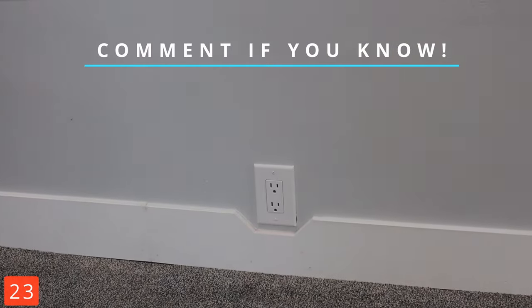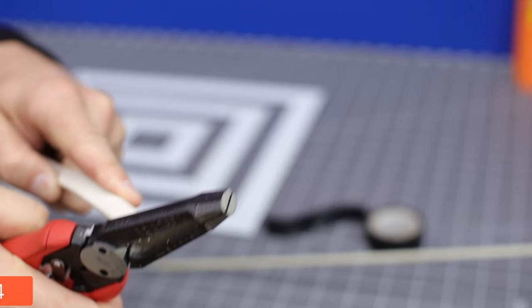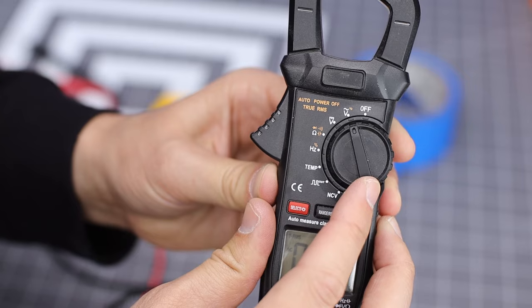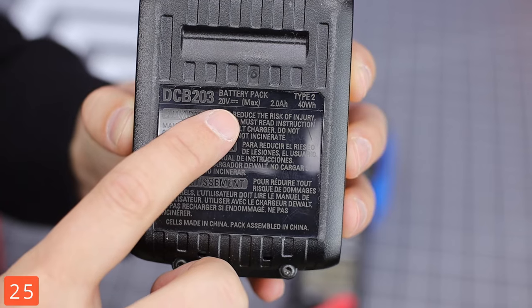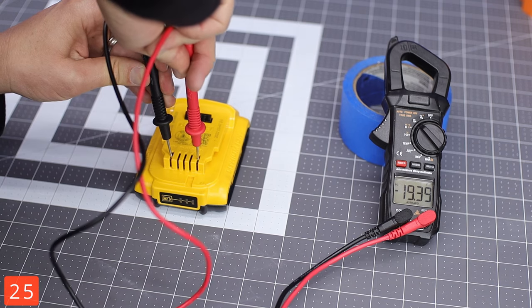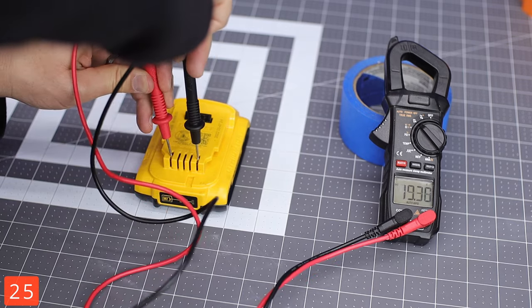What if the box is in the crawl space but the outlet is not? Angle the cut and tether the tape for a no-snag fish tape connection. Switching from AC to DC — all batteries have nameplates. You notice the line with the dash under it? That means DC. And yes, polarity matters with DC.